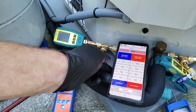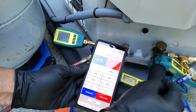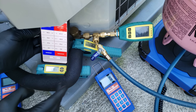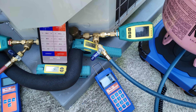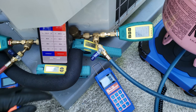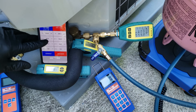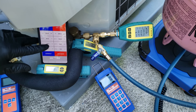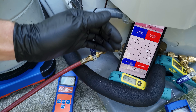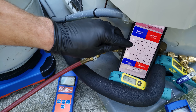The pressures were the same before, and now you can see the low side is lowering. The low side is over here and the high side over here. On the low pressure side, we see a pressure of 121 psi and a saturated temperature at the evaporator of 42 degrees. The temperature on the vapor line is about 50.5 degrees. This is going to need to run for about three minutes. Before we check the saturated temperature, we need to make sure it is above 32 degrees.